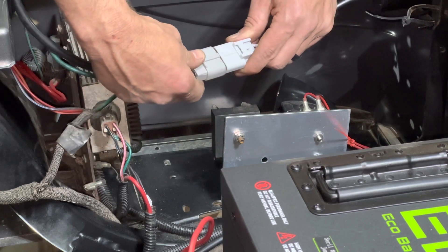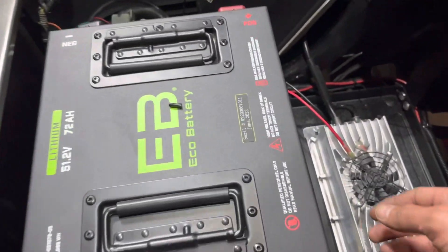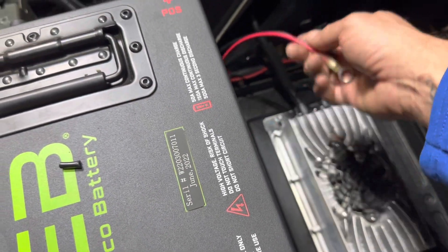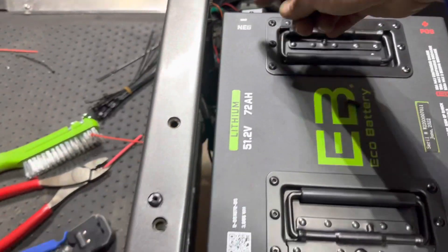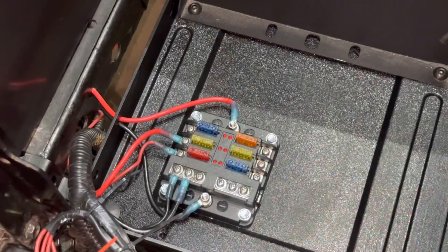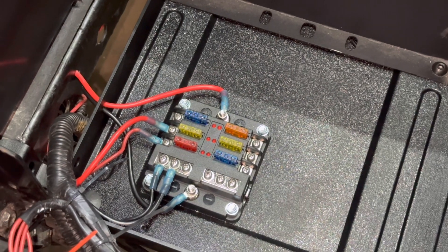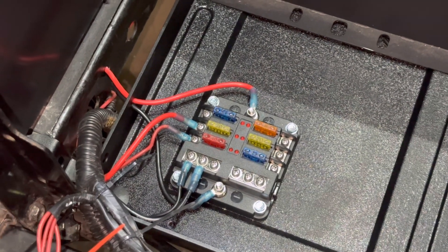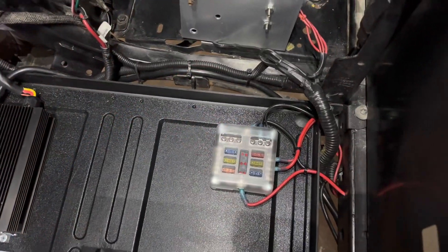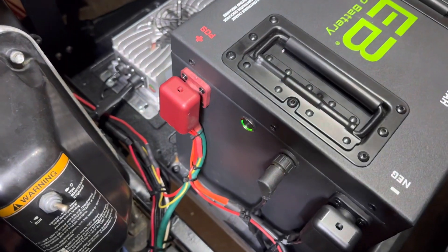Go ahead and plug your charger input wire into the back of your receptacle. The 12-volt output from the ECO 12-volt reducer — I extended it with some wire management, running it around to a fuse block. We have the fuse block installed with the main positive and negative coming from the 12-volt reducer on the top and bottom, and our 12-volt accessories connected on the side. Our 12-volt supply is hooked up and squared away — now we're ready to test the battery. Turn the battery on with the on/off button and it will illuminate.